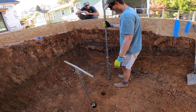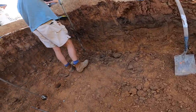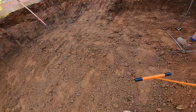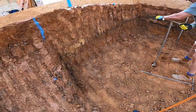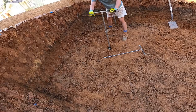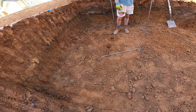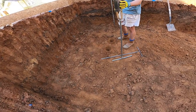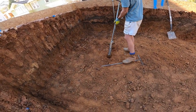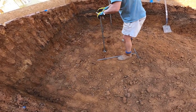And this thing's pretty pricey, pretty specialized. It was just a guy in a garage before, honestly. Every time I go into the office, I stock up on roll pins. This is the biggest thing. And see right here, I'm hitting a rock or something. Usually that's where I stop and call it hand auger refusal. After a while, if you get really rocky soil, the teeth on the hand auger will bend and snap off, but sometimes you're able to work around it.